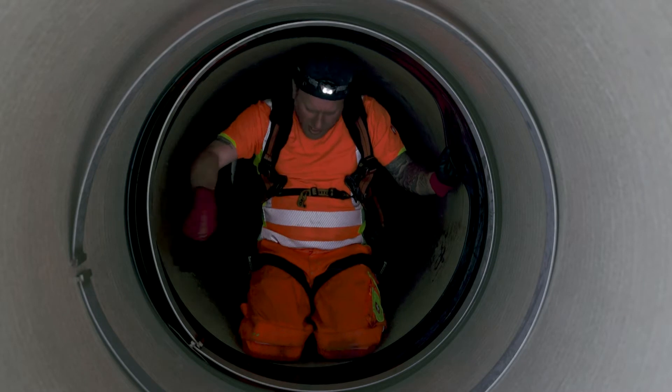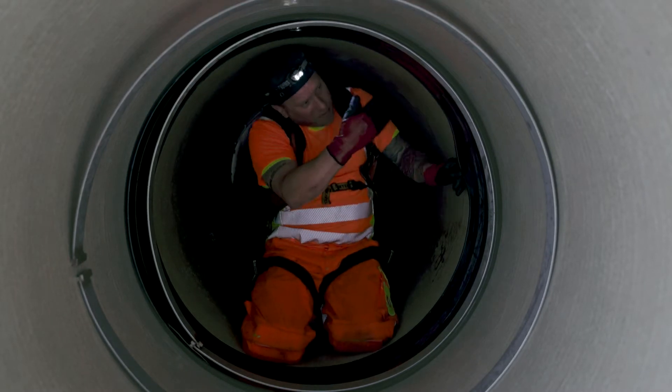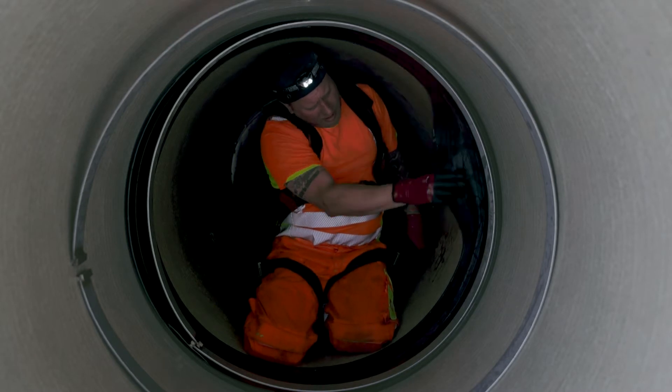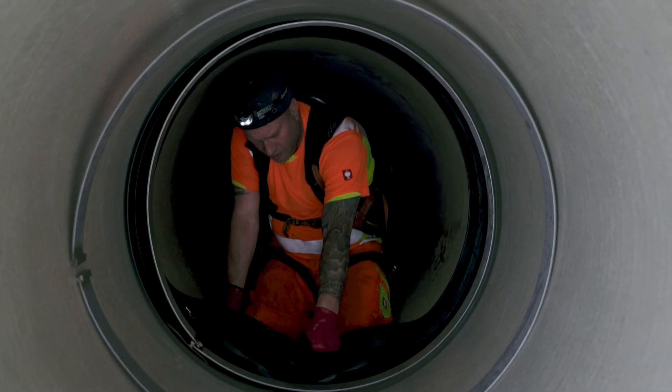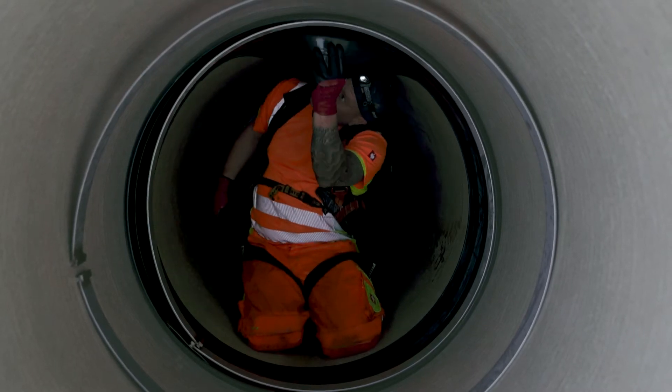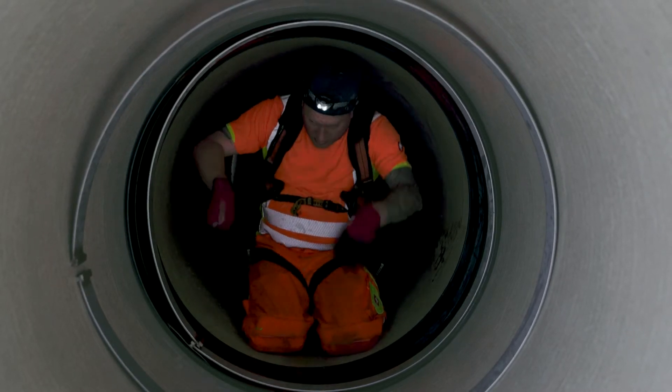It's very important to check the four points of the clock — we say 12, 3, 6, and 9 — and check that the seal is sitting straight compared to the joint. I lift the back and check there, there, and there. Everything's good, so I'm happy to open this ring up and get some compression on the ring.